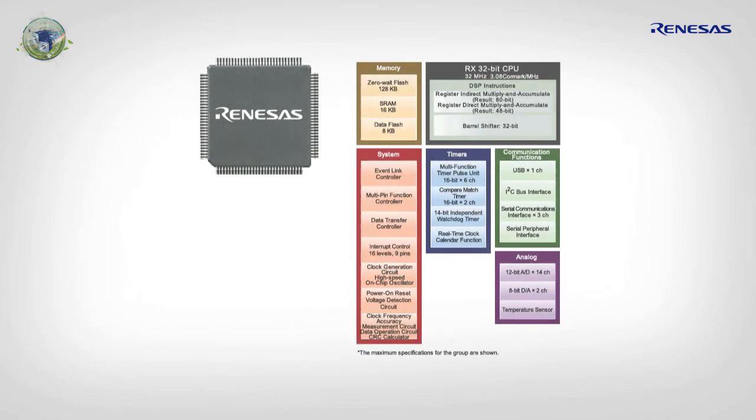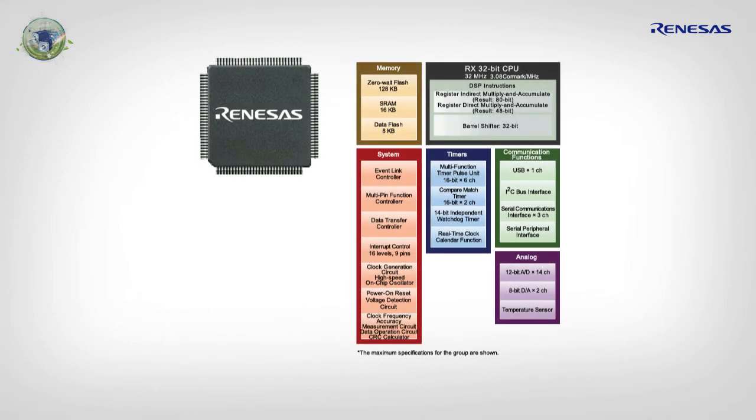So the main question now is: why is the RX-111 suitable for a three-phase inverter? The MCU is extremely robust against noise and offers one of the best noise immunity ratings, proven by an independent company called Langer EMV. The MCU delivers 50 DMIPS under 3-volt supply voltage, embeds the world-known MTU2 timer unit, and features a fast ADC to manage three-shunt measurements within one microsecond.